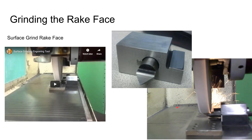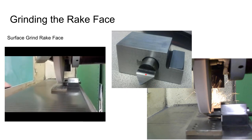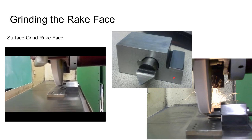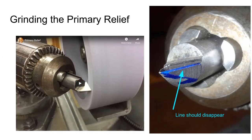For suggested steps manufacturing the holder, you're going to be given a long stick of aluminum and you need to figure out how to cut it in the proper sequence so that you don't do silly things like clamping on the knurls. After heat treating you'll grind the rake face, removing that last 20 thou or so — you milled it down to this level, then grind it down to the final level. Be sure to get with me when you're ready to use this fixture. It's a dangerous setup — if things are not done properly you can pull the fixture into the grinding wheel. This height has been precision ground into the fixture to give a neutral rake angle on the cutter.